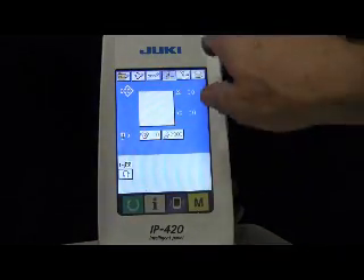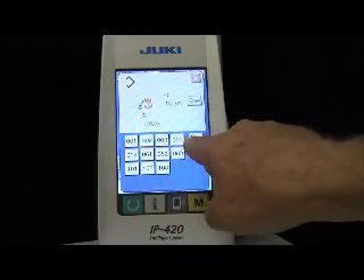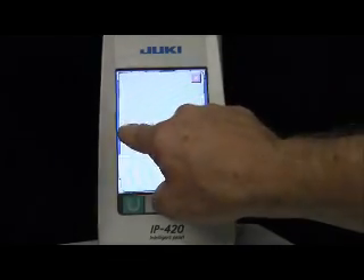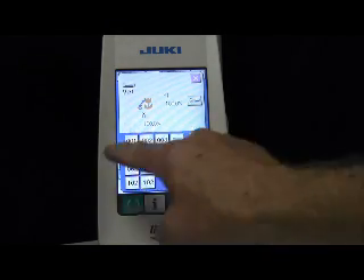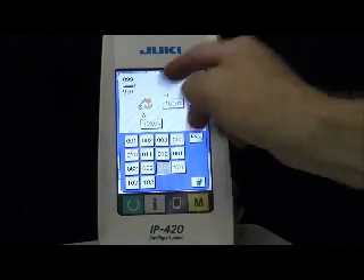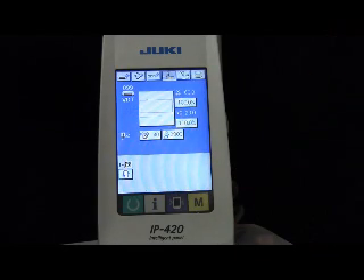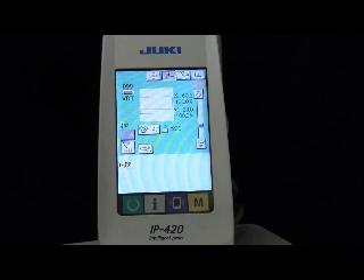You've got the blue screen with no program number, so you're going to need to select something. Touch right in the middle — these are the programs that are on the machine, but if you just wrote a program it's going to be in what's called the vector file, so you need to look over there. Notice 99 doesn't exist here, so hit this little button, and it's going to ask if you want program numbers or vector data — hit that one, accept it. Now there's program 99, so if we wanted to do program 99, we'd say yes, we want that one. You can change certain parameters here. It's converting it over to be sewn, and there's your program 99. To sew it, just hit your set ready key and the machine's ready to rock.